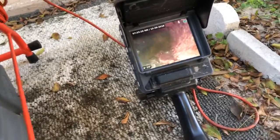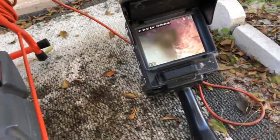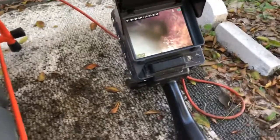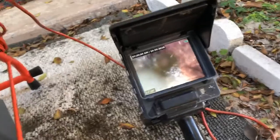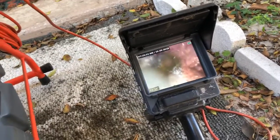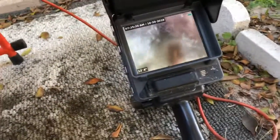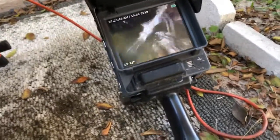So right here, we're not noticing anything major except water sitting in there that we'd rather not. A substance that can look gritty like dirt, but it could also be because of that Drano in there, okay? But see that? This is where your drain line closes up. So I'm going backwards from this clean out up that way, right? And this is where you're going to see the little roots hanging down. This is where we were clogged at. See that?